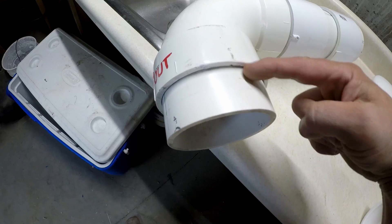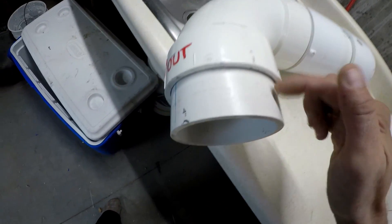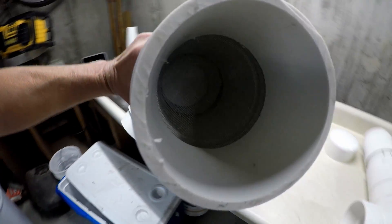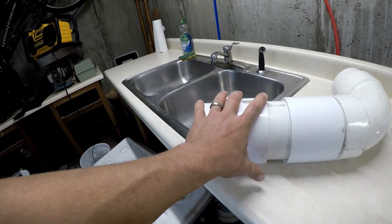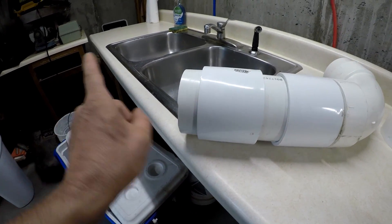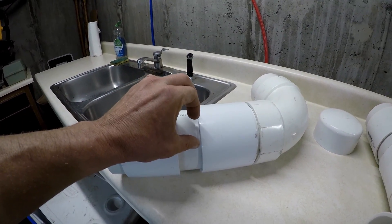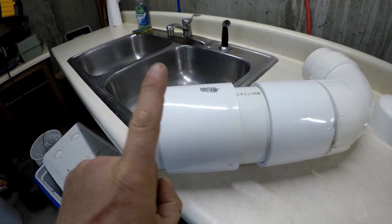It'll come in here and then go down into the root cellar right up at the ceiling level. I put an extra three-inch tube in there in case I want to attach something. Also what it does is it creates an internal bug screen, and also one for the outside. That's a blue screen, and that's a metal one — it's a mouse screen as well. Mice don't chew through the metal. This is going to actually be on the outside, so that'll be the exhaust. The hot air will be coming out there underneath the balcony. I have to take this off and slip this through from the inside and then go back out to the balcony and put that on.